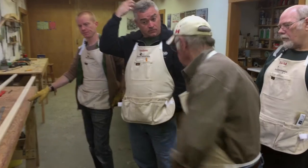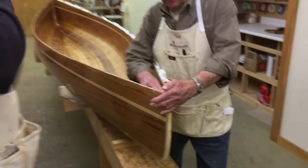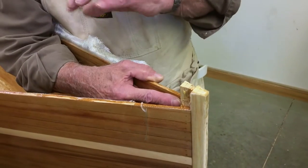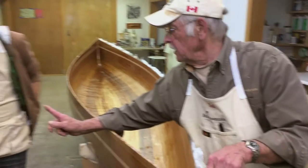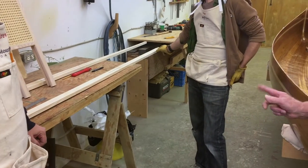That's what goes to the end. Now our in-wale is going to fit on the inside of the hull and come up together in a point here. So that means the measurement we want to deal with is to the inside. So we mark back an inch and a half from each end, which gives us this point right here.